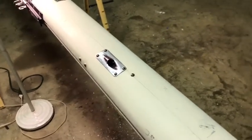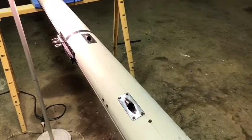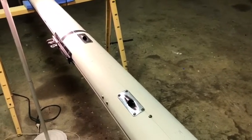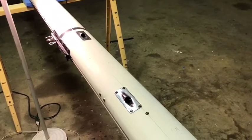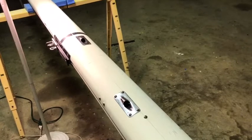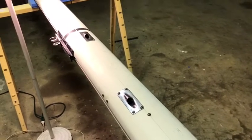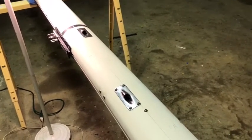This is the lower of the two exits. I've got both halyards running out the same side — the starboard side of the mast. The reason for that is the way this boom is configured: both blocks for turning the reefs back towards the mast are on the same side, which will eventually run them down the port side to the cockpit. So the port side of the mast and boom were already pretty busy, so I ran the halyards out the starboard side.